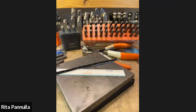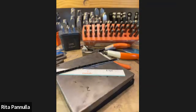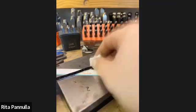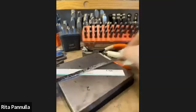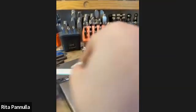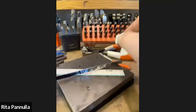Okay. Now, when you're using your paper towel, guys, you don't have to wet it. Make sure that it's dry. Okay. Household paper towel, nothing fancy. All right. And you're going to dab like we did before and lightly wipe. Okay. Remember, enamel takes off dry enamel. Sharpie takes off dry Sharpie.